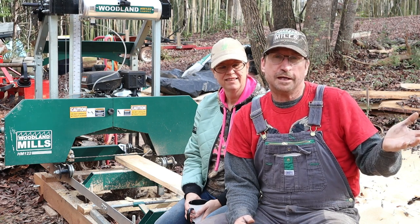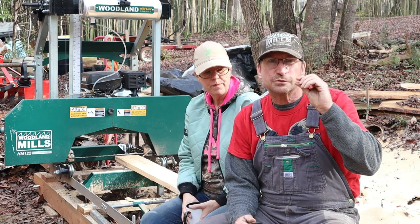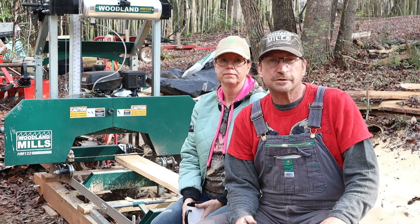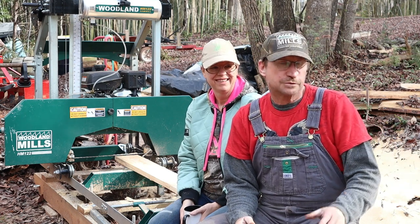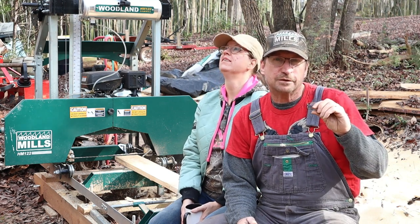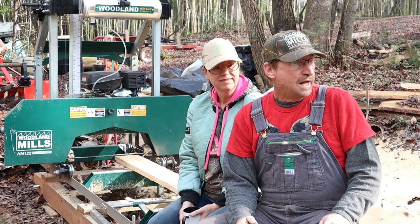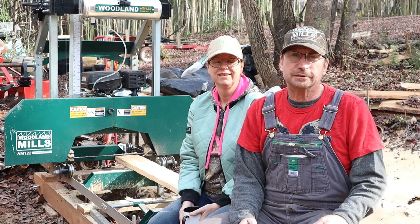So it's great, like I said, just to customize my wood. Because I only need those little strips in there to be thin. So I'll take those 6.5 inch boards and probably cut them into three different sections, maybe 2 inches wide or something, strips that she needs for the shop. So I can get three strips on each board later. Just going to wait for a little bit of the shrinkage to happen. So you always want to make it a little bit thicker than what you're going for, for shrinkage, and if you're going to plane it down. So I think that should be enough of the pieces I need to put up in there.